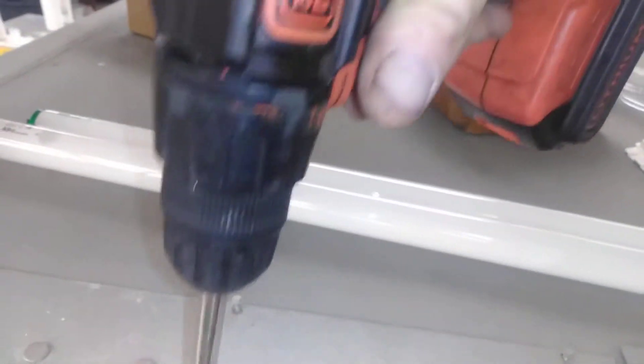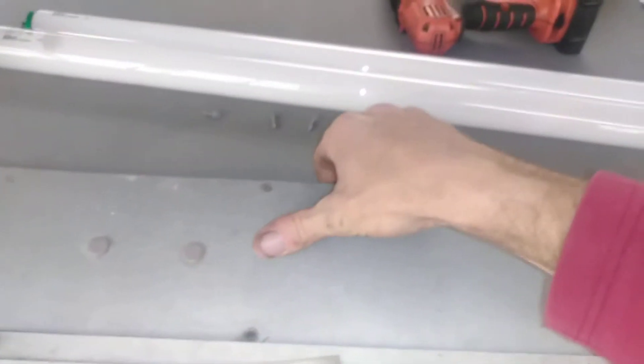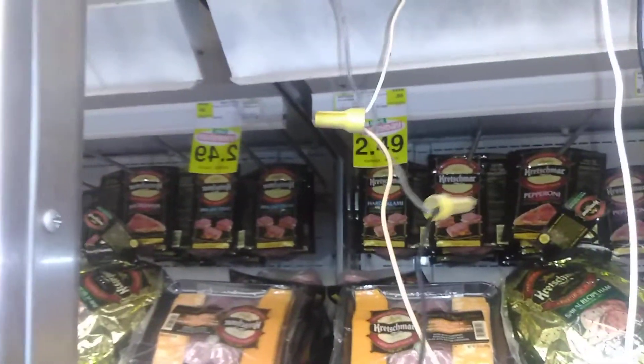All right. It was actually a piece of my screwdriver — I stuck the screwdriver in there and put it in my grill. That looks to be all of them. I'm going to put them up here. Should be able to pull this. This thing is like 30 pounds. We didn't get our ground wire — going to get the ground wire off. This is something you kind of hate to see: one connector, two connectors, three connectors. We're not sure why that's going on. They've got it elsewhere too. We're going to get rid of all these extra connections — they cause heat. I don't even know if they still make these.